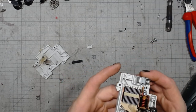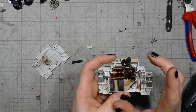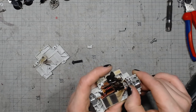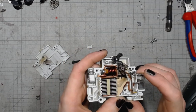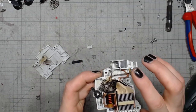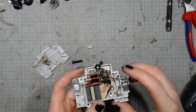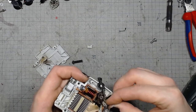What we can see in a miniature circuit breaker: this is the mechanism — the latching and tripping mechanism — and here it appears not to be working anymore. Here is a bi-metallic strip of metal. This is the overload trigger: when the circuit breaker takes too much current over an extended time, this will bend, tripping the latch mechanism.